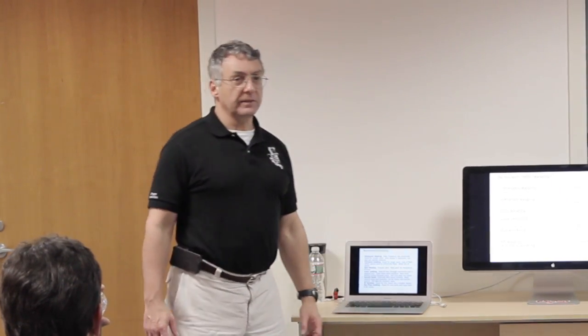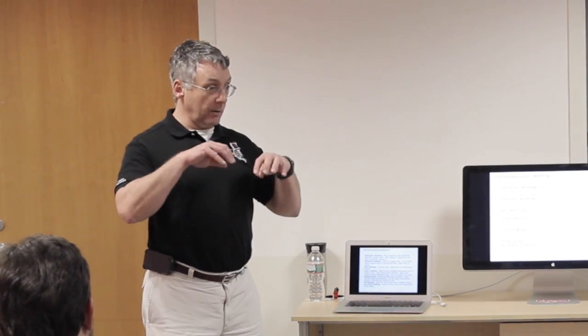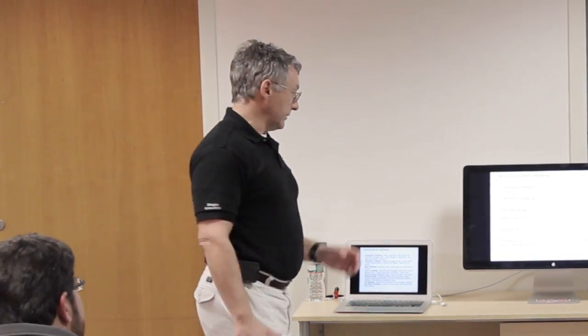Oh, and not only that, they did a software update. There was a bug in the software update because there's a big array of laser diodes, and all the energy gets pumped down through fiber optics to a fixture. So you've got 128 fiber optic bundles directing laser energy. They flipped a bunch of laser diodes, so all the programming was wrong, and it took us forever to figure it out. Because some places were melting, other parts weren't welding, and you just couldn't figure out why.